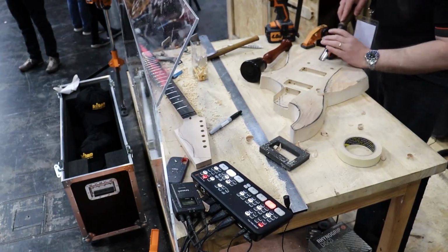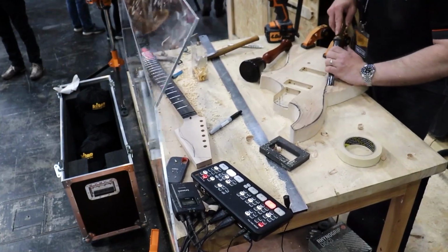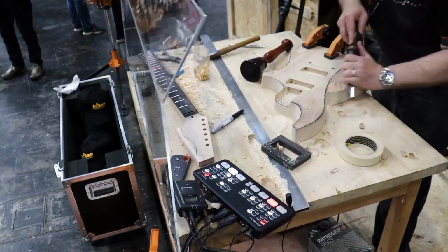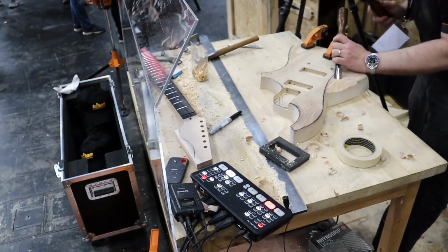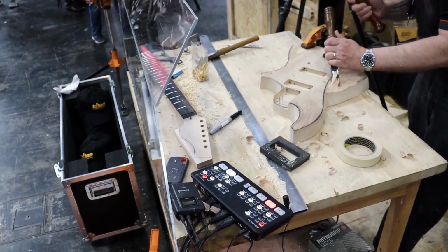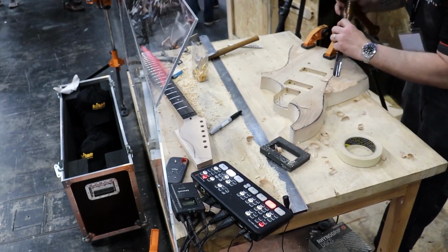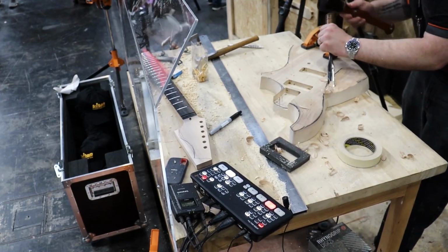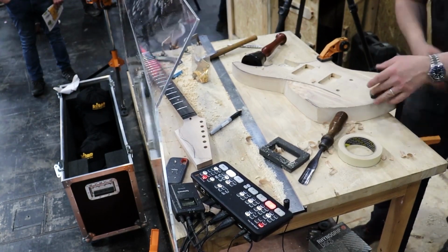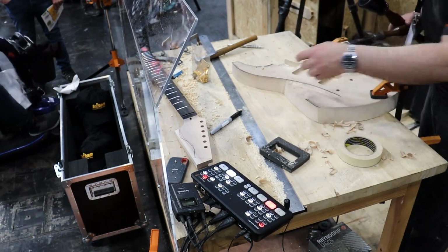Again, if I knew that I was going to design the guitar this way, I would have had a template and ran a router along in there. I like not having a plan going in. If you're not living on the edge, you're taking up too much space. I was following the design rather than what the wood wants me to do. If you're cutting across the grain, it's much easier. I might get some tear out there, but I can fix that later.